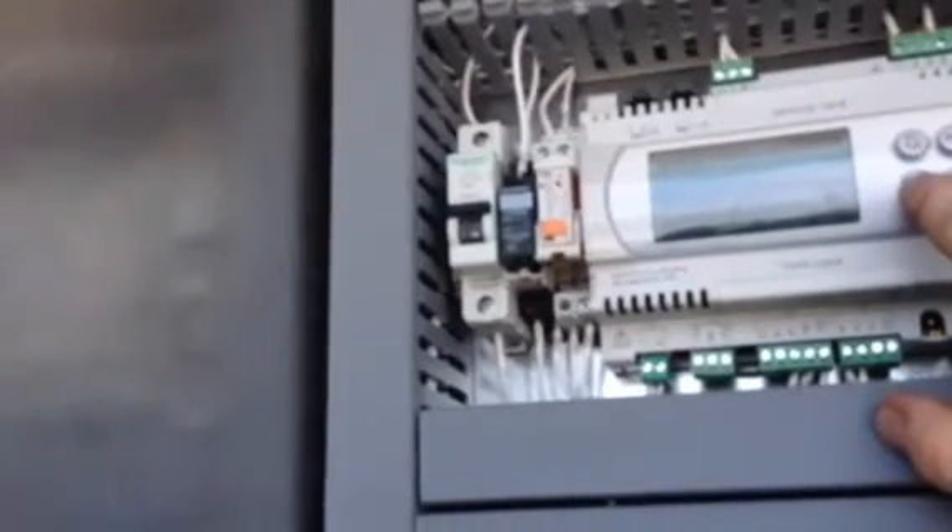I also got my wireless pressure probe hooked up, connected to my discharge line. I also got my discharge line temperature, so I can get a discharge superheat. We also have a Corral controller up here, and that will go ahead and tell us our superheat, sub cooling, and give us our suction and liquid line pressures.